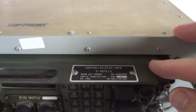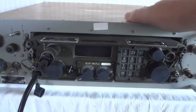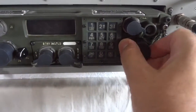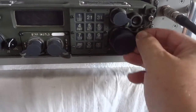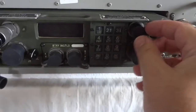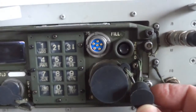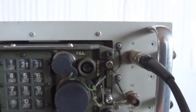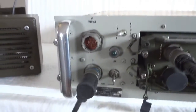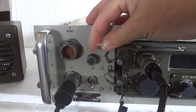This is the ID plate for the controller — it's the C11670G, the same one used for the RT-1512 receiver exciter version. This is an input for a sync unit needed for the frequency hopper. This is a remote control input that can be used to remote control the whole installation. That's the fill input — this is where you use your fill gun to set the hopping sequence. And this is to zero the sequence: if the radio is about to fall into enemy hands, you press this button and the hop sequence is erased. This goes to the pre-post selector. This is the switch for local and remote — we'll keep it in local for now.